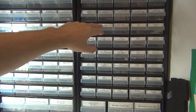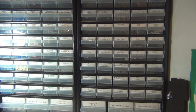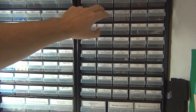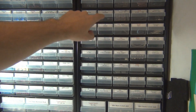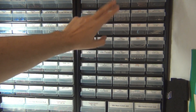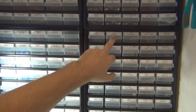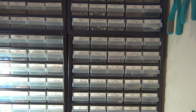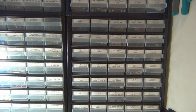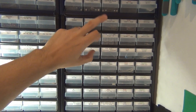The LM358N is used occasionally - I'd probably stock up on them. The RC4558 is used all the time; you can get 10 of those and you'll end up going through them. Even in modulation pedals they sometimes use a RC4558 for the on-board amplifier - it's kind of the go-to chip, cheap and used quite a lot. The RC4580 is used occasionally for amplification in some overdrives and things like that, not as popular as the RC4558 but used every now and then. You could get a couple of those without too much worry.